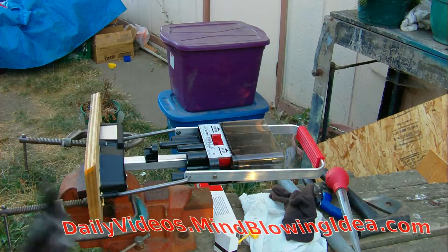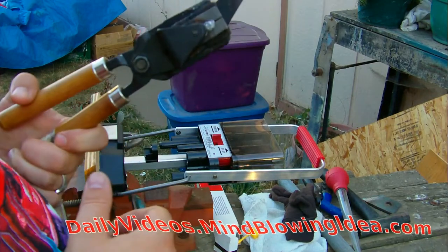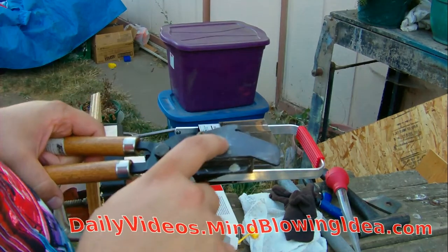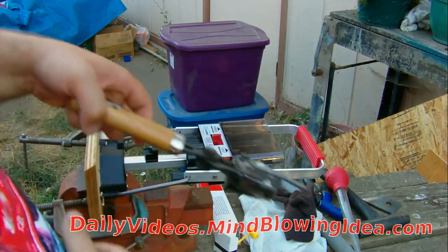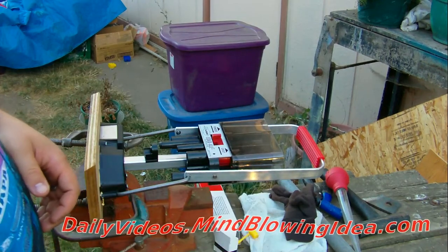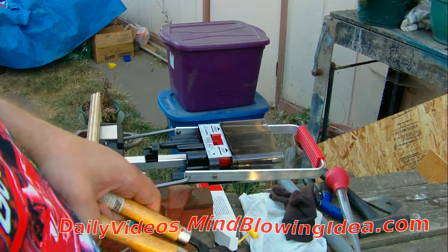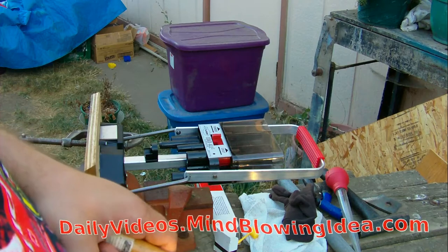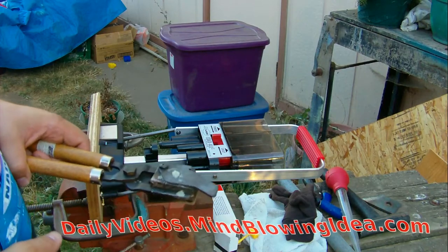Here's what you want to know — tips and tricks on the mold. First thing you do is get them hot. You dump a little bit of wax in, just a few drops or so — wax is flammable. Then you take this and dip it into your lead just to warm it up a bit, like you saw in my other video. After it's warm enough, you start pouring some lead in it. When the lead won't stick and starts running off, then you know it's hot enough. Just pour lead in here and tap it — my wife taught me that you tap it to make sure the air bubbles come out. Always wear welding gloves and take all the other safety precautions.